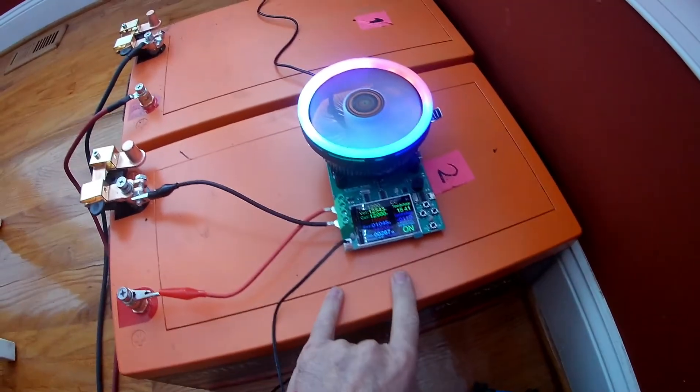My first battery took about 24 hours to discharge. I discharged 295 amp-hours. By using the Victron battery charger, I was able to fully charge it back up and it took 295 amps. So that gives me some confidence — that's pretty close. One percent here and there is fine. Everything else so far looks like they are 300 amp-hours each.